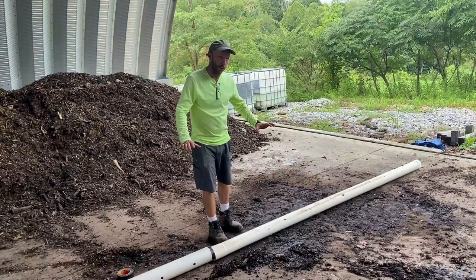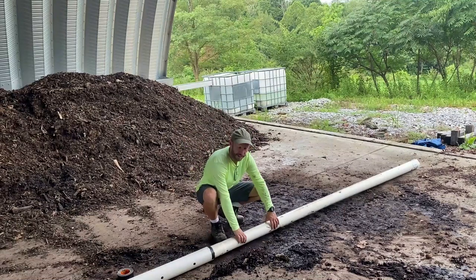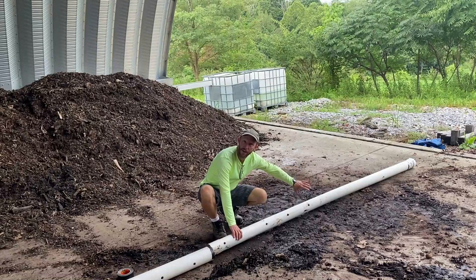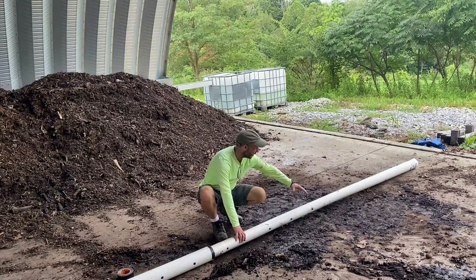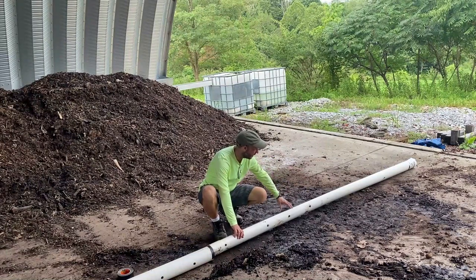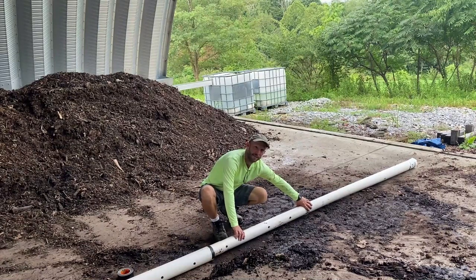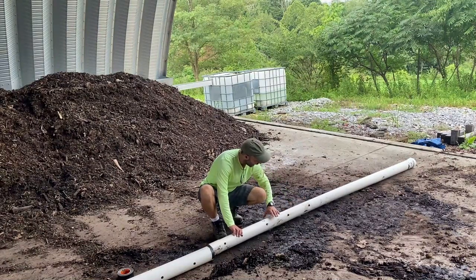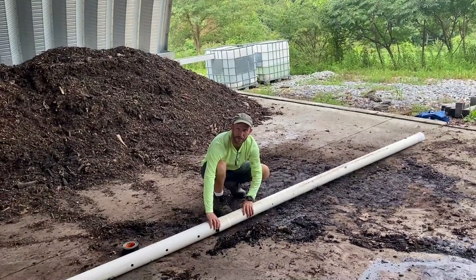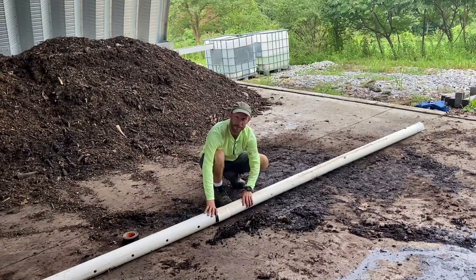Okay, a few words about the placement of the pipe. This end pipe, as you can see, it has holes, but not all the way down, right? You're gonna have material up to here and a little bit beyond, and then capping material, but the holes end a good at least 4 feet from the end, more like 6-8 feet. And I'm going to connect each of these sections with a little bit of duct tape or gorilla tape. It doesn't have to be perfect, but just to keep them placed.